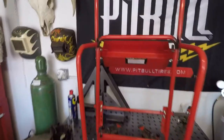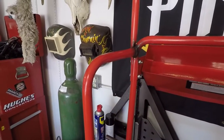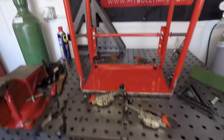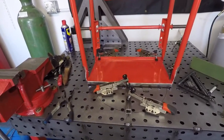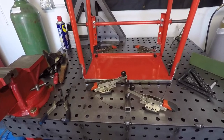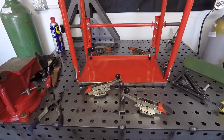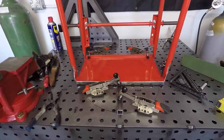I got these little slots I cut earlier, welded them in, and ground down the bottom so I could weld it in. Now I'm adding a support on the front for the front of the bucket for the dust separator. I'll get that all welded up and then show you the rest of the framework.